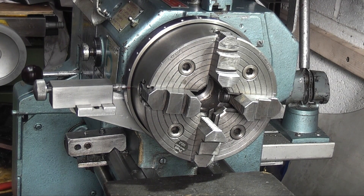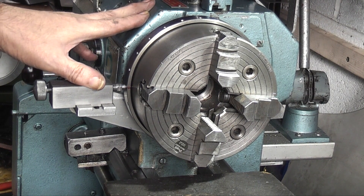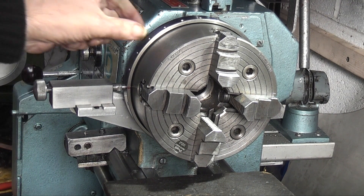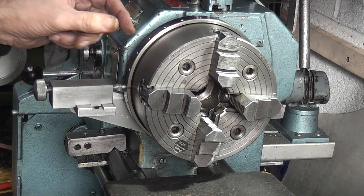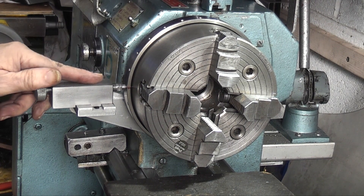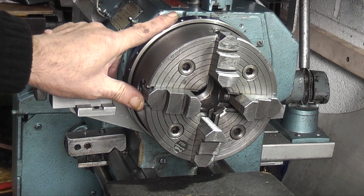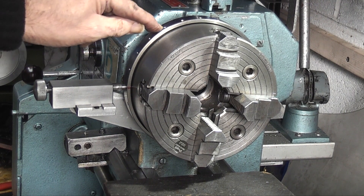So the first question I had was how do you fix the arm to the headstock. Well there should already be some holes drilled and tapped — they will be imperial 5/16 I think. And the second question was how did I fit the ring onto the headstock. Well I didn't — I fitted the ring onto the back of the chuck mounting plate, and the mounting plate to the spindle. Make sure it's running true — well it was about 5 thou out so I just skim the face. And then someone's going to ask how do you put the holes in. Well I did this on the dividing head on the milling machine, centred up on the centre of the ring and just drill the first hole, then move to the second hole and just go around.